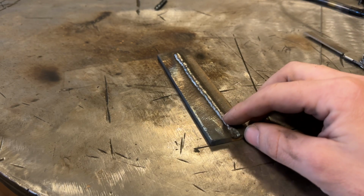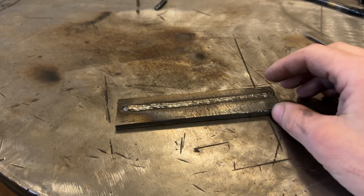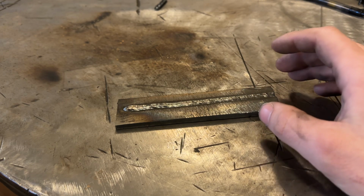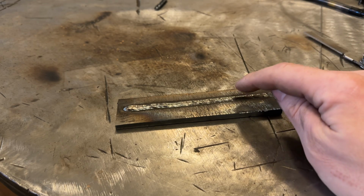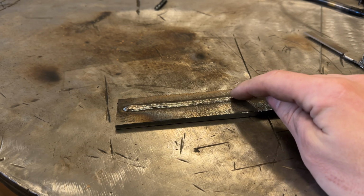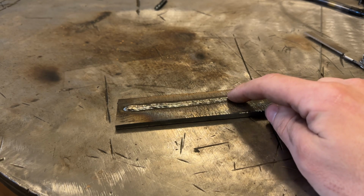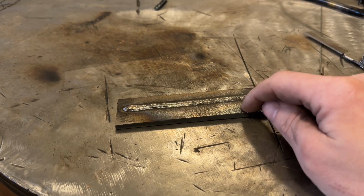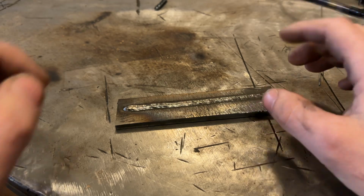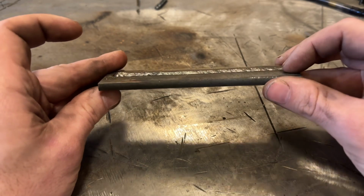There's also hard facing rods for corrosion resistance. Now, unless you're in an industry that deals with corrosive chemicals, you probably have never seen or been exposed to those kind of rods or fillers, but those do exist as well. This particular hard face would likely have very high corrosion resistance as well, simply because this is an alloy of stainless and manganese, so it goes without saying that its corrosion resistance is obviously a lot higher than the mild steel.